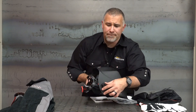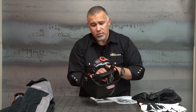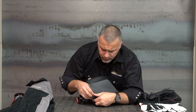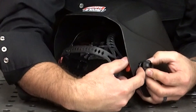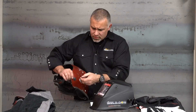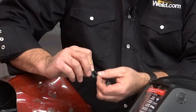There are adjustment knobs on the outside — these are what hold the headgear onto your hood. When you loosen them, it becomes really loose and goes up and down very freely. If you find yourself getting hit in the face, you might need to snug those up a little bit. If you've had your hood for a while, it might be time to replace the tiny little rubber grommet inside here. That grommet is what's holding the tension on your hood. If you take one of these apart, make sure you don't lose the components. If you lose it, you'll have a hard time tightening your hood.